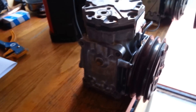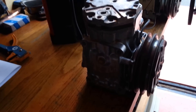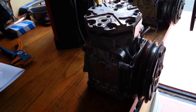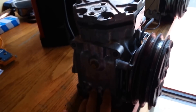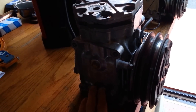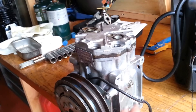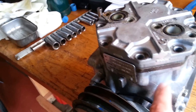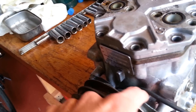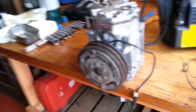These things, unlike more modern axial compressors that you're used to seeing, the modern ones circulate oil around the system, and that's really only used to lubricate the internal mechanism of the compressor. This thing, on the other hand, is just like any other air compressor you would imagine, or even a reciprocating conventional refrigeration compressor. It has the oil here in the bottom, and it uses splash lubrication to lubricate the crank. I do believe there is a small hole in the suction reservoir which, through a pressure differential, oils the crank bearing here in the front.